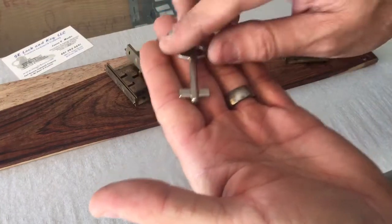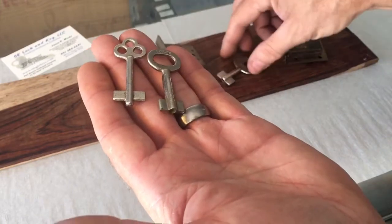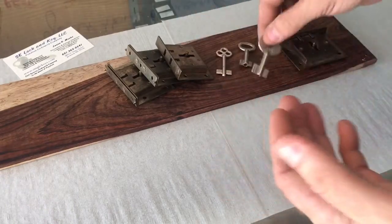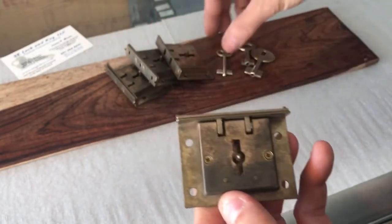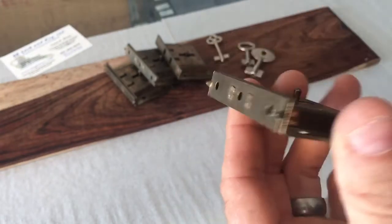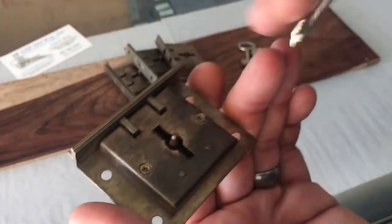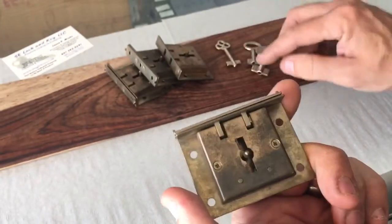The three main types: there's one that is a bit style that is not hollow and they all have these wings. Number two is the barrel style key, used for locks like we have laid out here that have the center post. It's very easy to tell which type you have. The ones with the post sticking out the center use the hollow style keys. Beware that post can break, so if you look down in there and see a hole with no post, the post may just be broken and missing. That's very common as these get older.